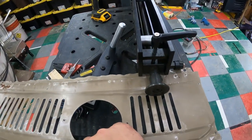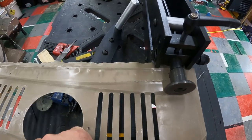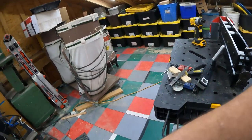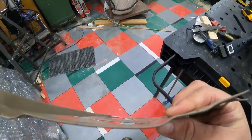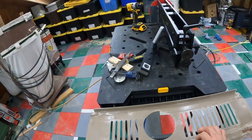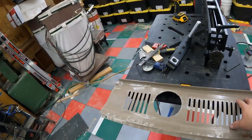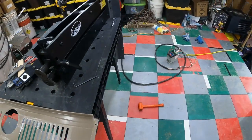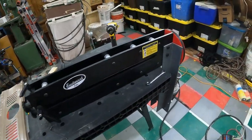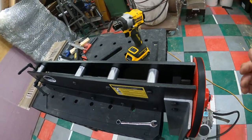Despite the broken hub, it seems to be working all right — that's a pretty healthy quarter-inch offset in one shot. This is 18-gauge metal, and it's pretty decent. One of the main things I'm going to be doing is making a whole new floor panel for the Jeep bed, and I'll likely use the offset dies for that. If I get a good setup, maybe I'll pump out a bunch and give or sell them to people who are interested — but I don't want to get ahead of myself.